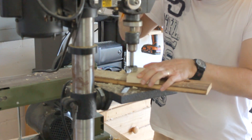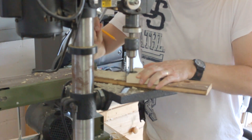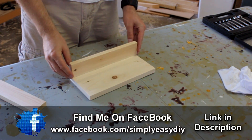After that's all said and done, I'll take those two pieces over to the drill press. A one inch Forstner bit gives me the cut out for the neck of a wine bottle. I'm not just eyeballing this — I did mark this out because I want it centered on the piece. That placement will be on my website as well.